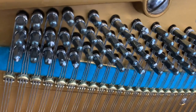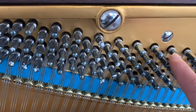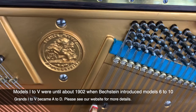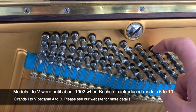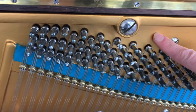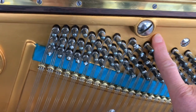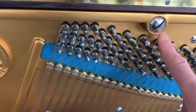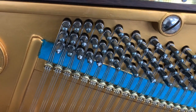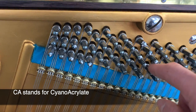Now you might have noticed that I've marked some tuning pins here. I've pitch-raised it from just under concert pitch to about 442, just to test all the pins. Because the common problem with pre-1902 Bechstein uprights, or rather Models 1-5, is that the wrestplank — even if you put new tuning pins in, even longer ones — you still end up with some of them being loose. The wood behind doesn't seem to stand up to being restored like this for modern central heating. So you need to put a new wrestplank in, which we've mentioned many times before on videos. And I've marked the loose ones.